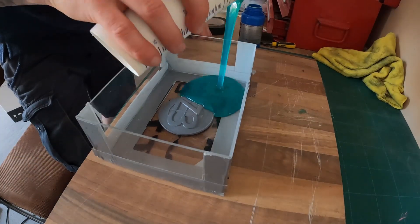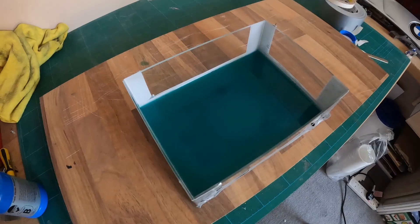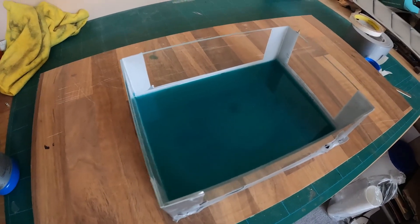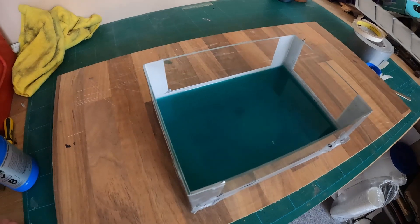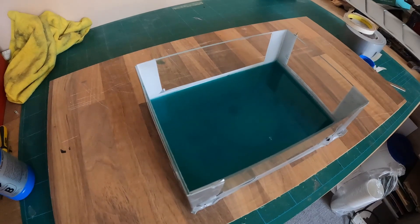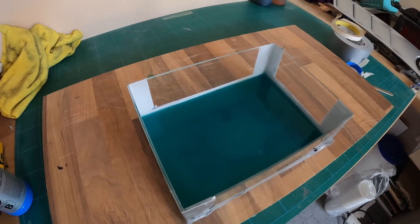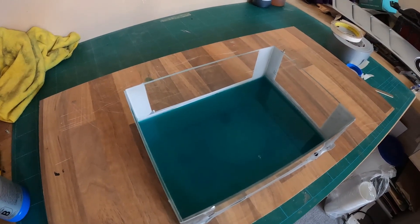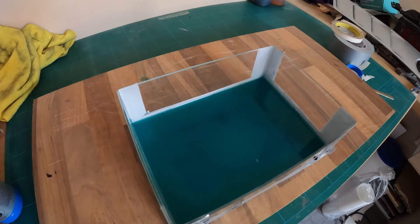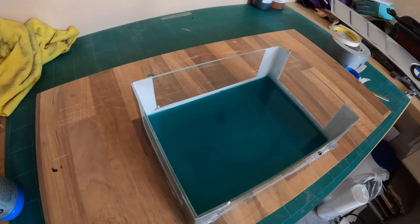So I'm just going to start at the corner and pour it in. That's it, just been poured. It takes about four hours to go off and then we'll break the pattern out. Rule of thumb is: if the part you are moulding is a gloss finish, it will come out with a nice gloss effect on the black casting resin I'm using. If you were to use a matte lacquer on the part or it had a textured finish, it would more than likely come out with a matte finish. But we'll show you once it's done — it'll make more sense.